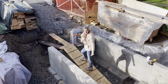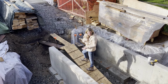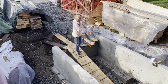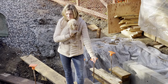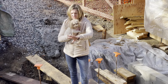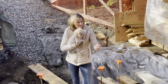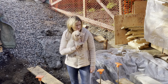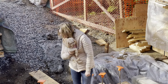In-ground plumbing. There'll be some in-ground plumbing, mechanical run underneath the slab, power line will be in, waterproofing the exterior wall. We just have to let it dry a little bit first. All the insulation needs dry concrete. And then we'll have a whole build-up: some dimple board, some gravel over there.